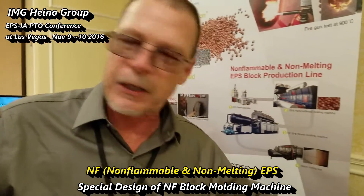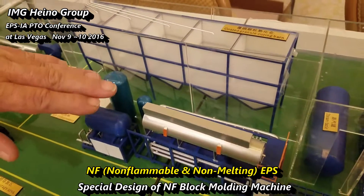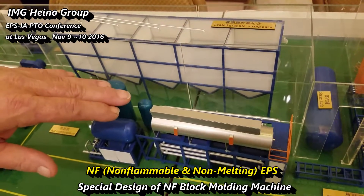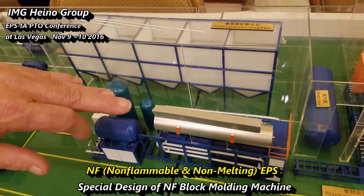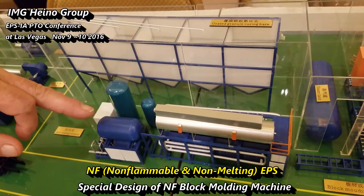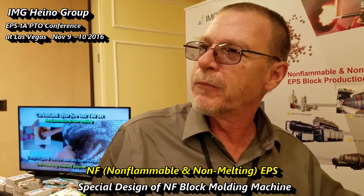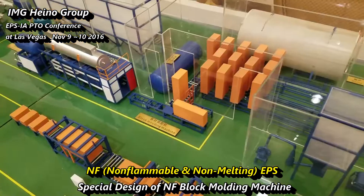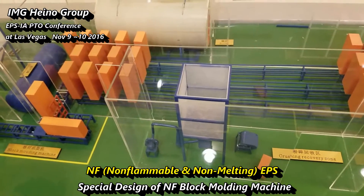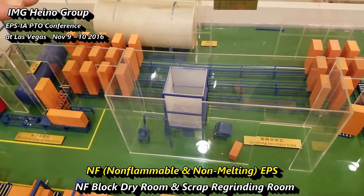The mold is a special mold, although the block mold side of it is virtually the same as any standard block mold. The actual mixing hopper on the top makes sure that the material stays in a fluidized state, meaning that the material stays as individual beads versus becoming clumps. That makes it easy to fill the block mold and actually mold the block product. It goes through a standard cycle in the block mold, and the actual fire-rated material comes out in block form.